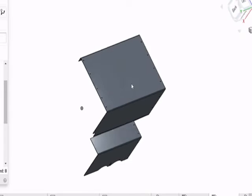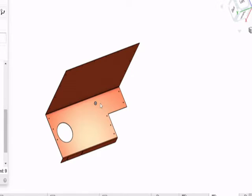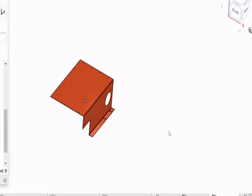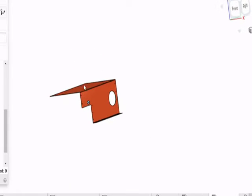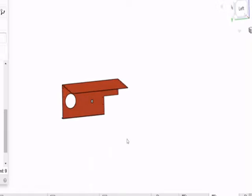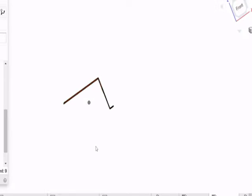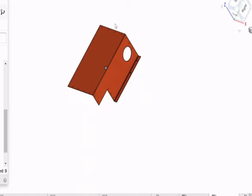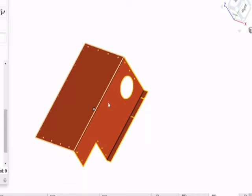This one I call the top of the thing, because it's going to be the top of the box over the muffler — it goes over the top of the muffler. Then this flange down here will go right onto the head of the engine. This is the hole where air is going to enter the box to keep clean air in there. Looking at it from the end for the bends: it's got really just a bend down here and then that flange bent that way. This face with the toe in it is going to bend down away from the big top, and then the flange along here will bend out to be parallel with the big top up here.